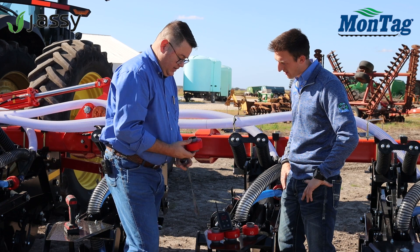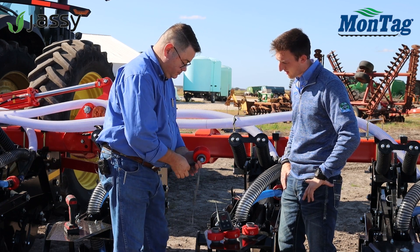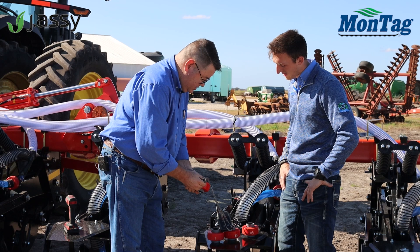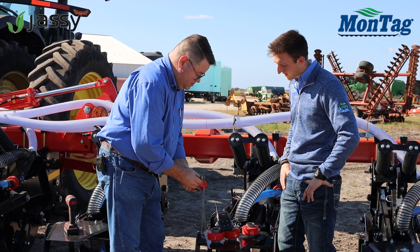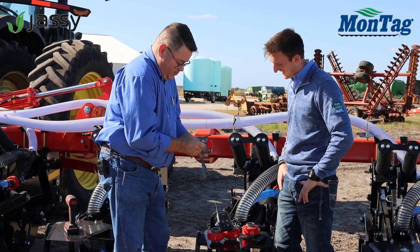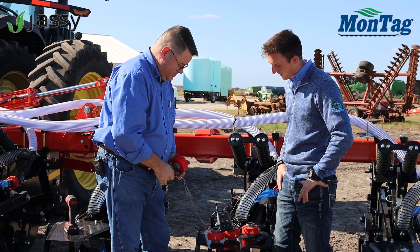So let's say we've already got this as our brand new sensor. We're going to shake it up vigorously. Then we take our magnet, put it right between the two S's, and hold it there for about five seconds. Because we're doing this live, it doesn't work right away — so be a little aggressive, shake that up. There we go. Now it's addressed.